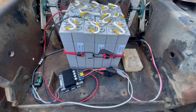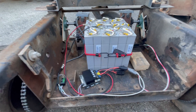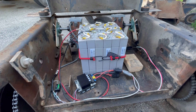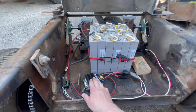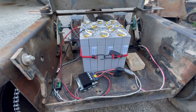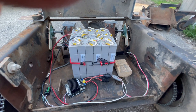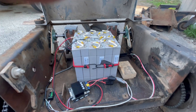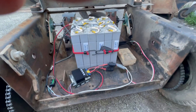There's no heat generated from the connectors because it hasn't been a continuous run. I am reaching the motor cutout current though - I can tell that. My amp clamp battery is dead so I don't have a way to check what the current is actually going to each motor, but I'm reaching the maximum output of this drive. I think for a first test it's been good - gives me an idea of what I need to do better. I might need to go looking for higher power motors, because these will get hot for continuous duty use, and I don't know how they'll react to pushing the mower deck around in the grass.